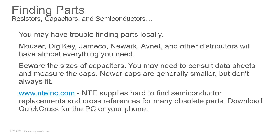Beware of capacitors. If you're buying capacitors for something, you may need to look at some data sheets and find out what you need. A nice cheap pair of calipers is your friend with this, because then you can measure the physical size, look at the data sheets, and find what you need. For example, the K7000, if I remember right, or was it 7400, monitors have a vertical output IC with a heat sink that is rectangular shaped, kind of like a bracket you see on your keyboard, you know, the bracket key.